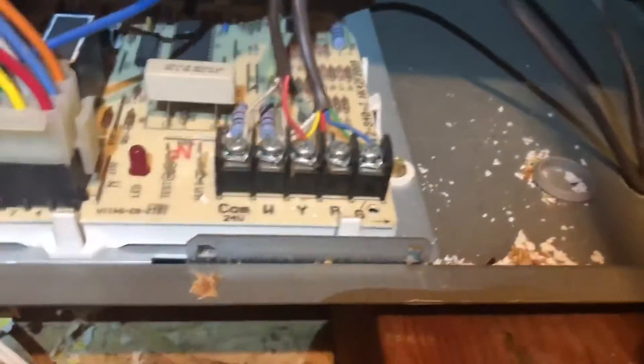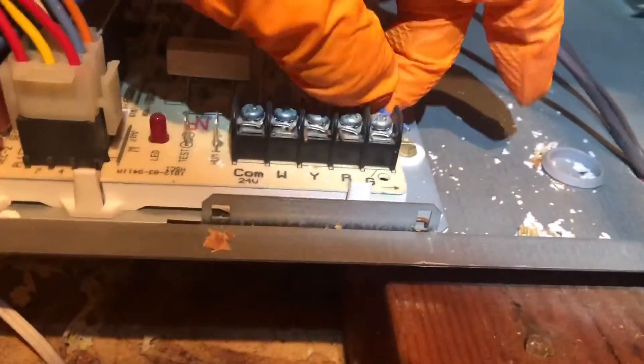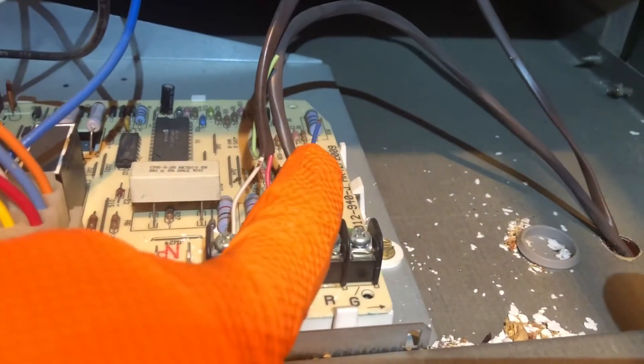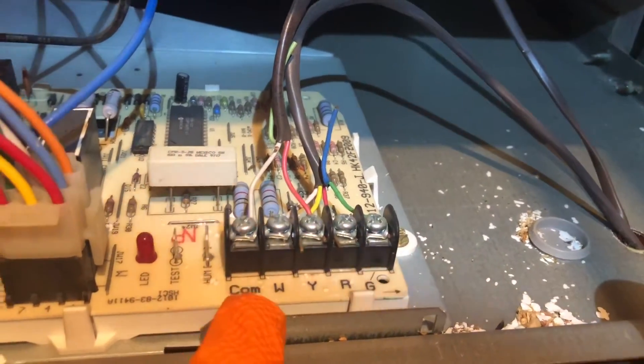Here's my system. Looking closely I can see all the wires — there are two different lines. One goes to the outside air conditioning unit, the other goes to my thermostat. The outside unit usually just has two wires hooked up: one going to common and one to Y, the other half of the air conditioning system. On the furnace end, here's that blue wire I was talking about by the thermostat. I'm going to get this blue wire and hook it up to this common. The common already has the white wire going out to the air conditioner, so this will be a second low voltage wire — I'll end up with a white and a blue wire going to this common.